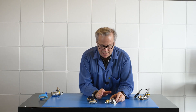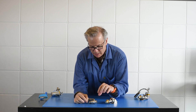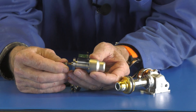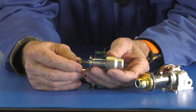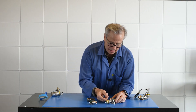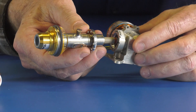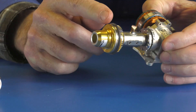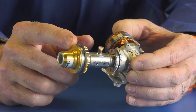I've assembled these items back together just to drive home the point of what the regenerator does. The regenerator slides into the back of the Dewar here. You can see this is the linear case and you can see the regenerator in its bore in its Dewar. In the case of the IDCA, there's the regenerator in its bore with the Dewar at the end of that bore. The focal plane is in this volume, and that's where it's cooled.